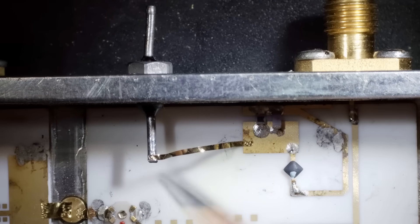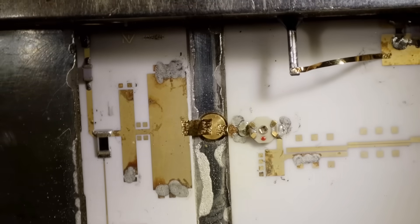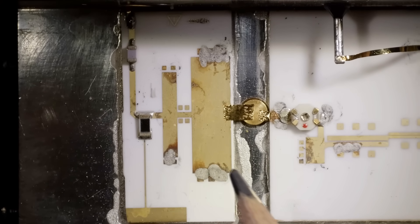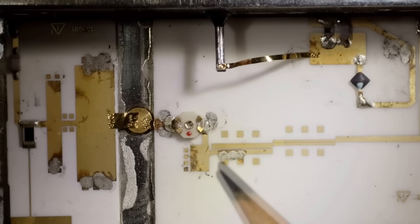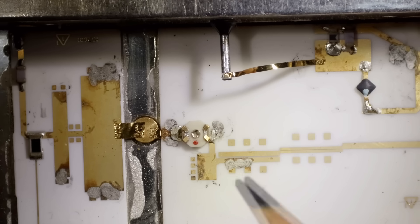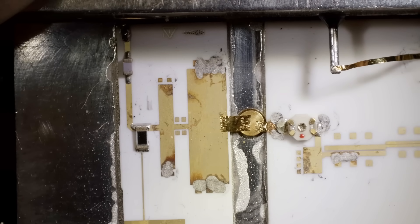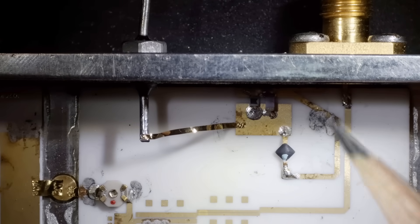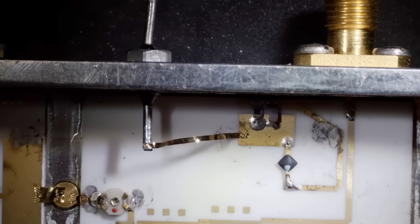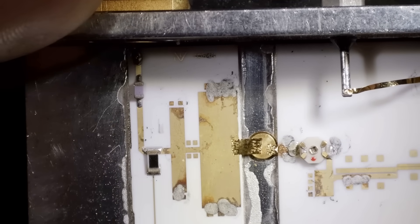This just detects the kind of amplitude that you have. Isn't this thing ugly? There's silver epoxy that the thing is attached to the base with — this substrate — and they use it to match. This side and that side are going to look the same: there are three squares here and three squares there. They kind of glob it on so you have a big blob of capacitance. Then they make this side a little bit longer and these two sides a little bit longer. I don't know what went on with that big blob there — that one makes no sense to me.